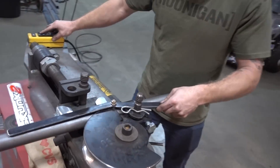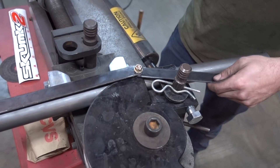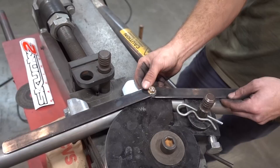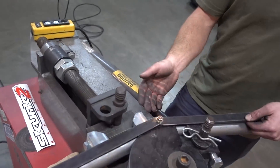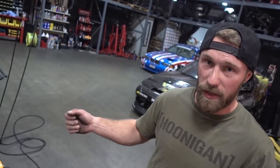Basically you took a line-of-sight measurement — all of them are line of sight. If it doesn't line up, do you just take it back or start all over again? I try to underbend everything so I can leave a little bit of room to bend a little more. Now if I overbend it, hopefully I only do it by a little bit and I'll grab something really heavy like a lift pad and kind of hang on it. You can bring it back, but really you can't take back a bend. So I always undershoot rather than overshoot.